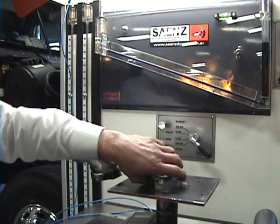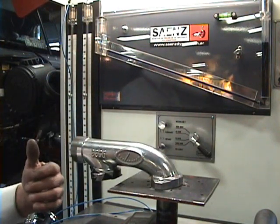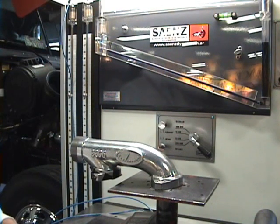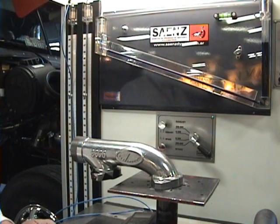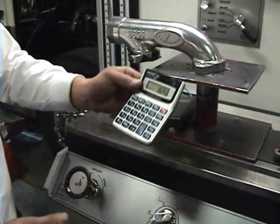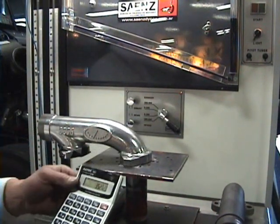So you're moving more air through that — and they're both the same diameter. So by moving more air through the same diameter hole, we're increasing the velocity of that air also to spool up the turbo a lot quicker. At 54 percent times 653.2, that's 352.728 CFM of air.